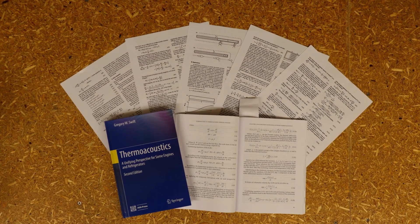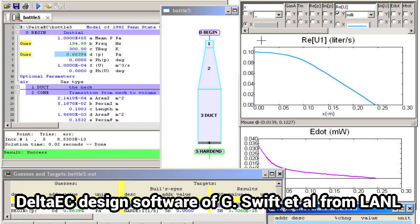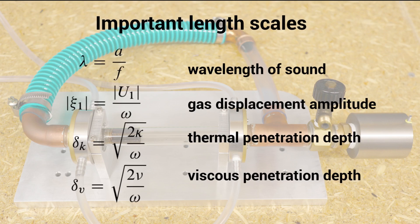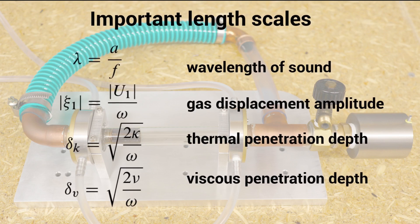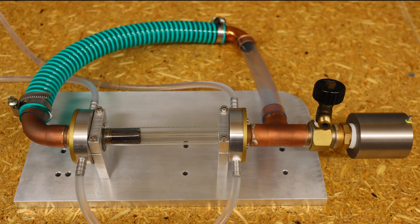To calculate a completely new design with the help of Theory and Delta EC, my understanding of Thermoacoustic principles is not yet sufficient. I therefore relied on the most important length scales of wavelength, gas displacement amplitude, thermal penetration depth, viscous penetration depth and the scaling of a well-functioning prototype.